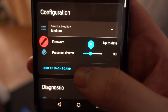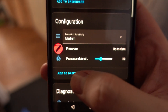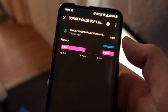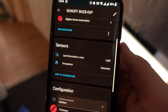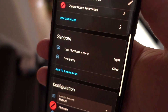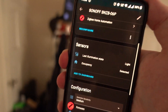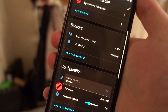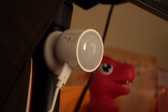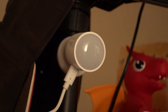As for how to set this one up, it's remarkably simple. Assuming you've already got something like Home Assistant and Zigbee set up — there are videos in the cards above if you want guides on that — you just pair it like you would any other Zigbee device and then set up an automation for when the occupation state becomes occupied and another for when it becomes clear. It's spot on for accuracy, although I would mention that the built-in light sensor is pretty annoying. It's a fixed value that just changes between light and dark, and you can't control how light or dark it has to be to trigger that — for me it triggers way too late. I'd like to be able to make it turn on my lights when it's just a bit brighter than it's set for, but that isn't possible with this sensor.